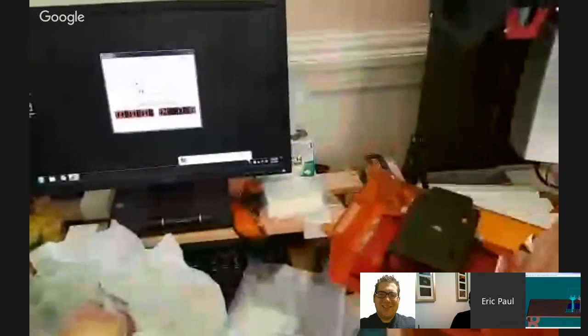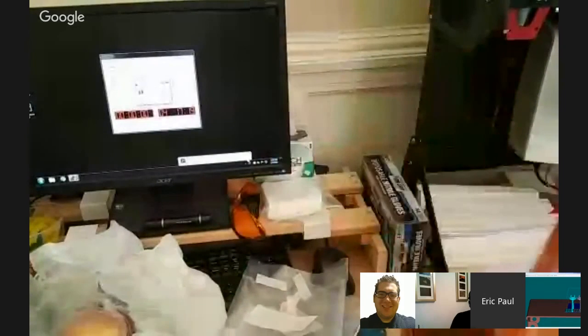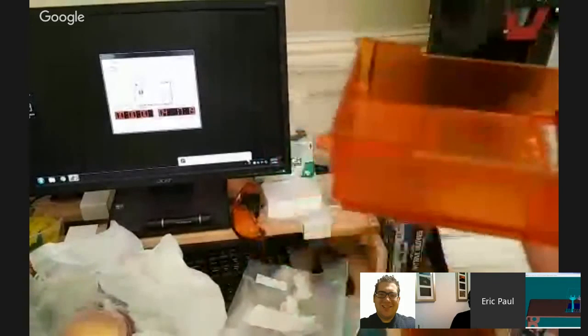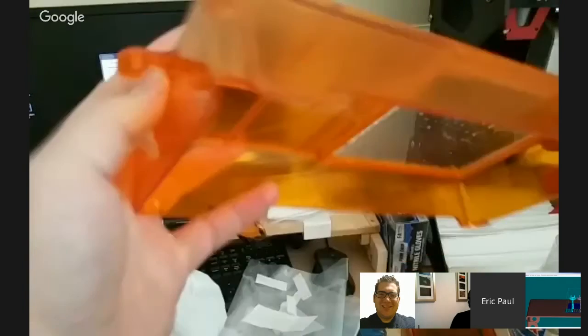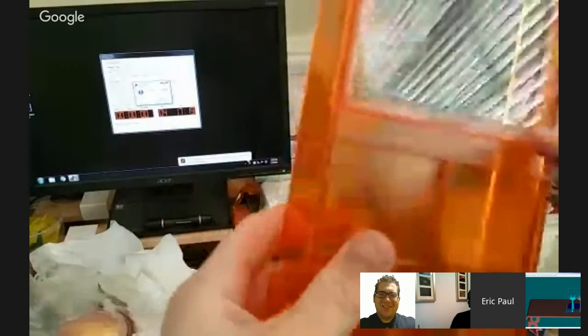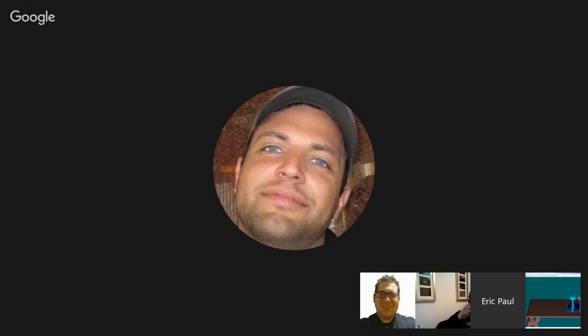This is a dead vat. It leaks. Get all the stray papers out of here. But with the new polyvats and the self-leveling PDMS, I can calibrate any build table to this, and it will be calibrated for all the other vats as well. So I keep this here. What I did is I took a hot glue gun and filled in this, so I made sure this is sitting in contact. It started leaking resin right here after 6 months.